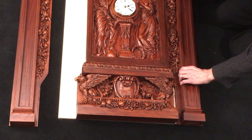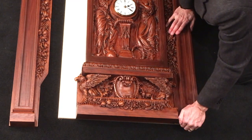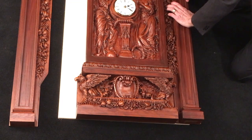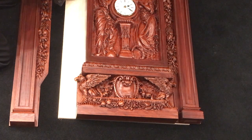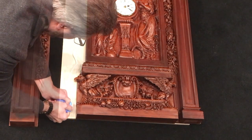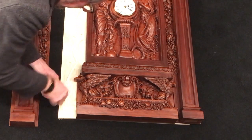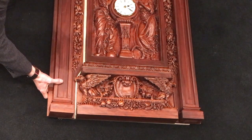If we could have cast it hollow it might be a little different, but we had to cast it solid because we're going as thin as three-eighths of an inch but then as thick as almost four inches. So you have a wide range of thicknesses on the resin. I'm applying the glue on the plywood for these two pilasters as well — the first two pieces got glue on the back, and the next three pieces get glue on the plywood.